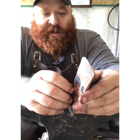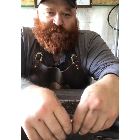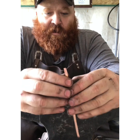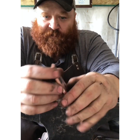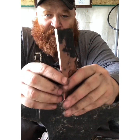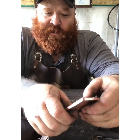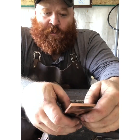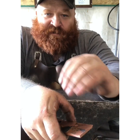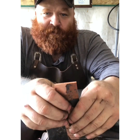It's a pretty easy process — a lot easier than working with a ferrous material, which is iron-based, because copper is so malleable under heat that it doesn't take much to get it to stick together. It's not perfect, but since it's folded so many times, it would have fallen apart as soon as I cleaned up the edges if it wasn't welded. There were a few air pockets — what you do when you find one is take a chisel, open it up, and weld it the same way you would with a bubble in a Damascus steel billet: cut it open, flux it, and weld it back. There's no flux involved in welding non-ferrous materials though — you just heat it and beat it.